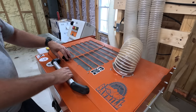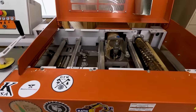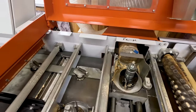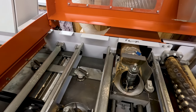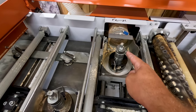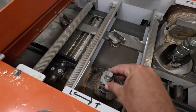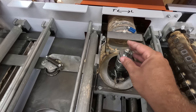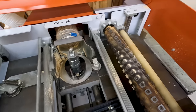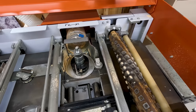Let me explain why we took all these boards down to Hawkins County and ran them through that edger. Alright friends, if you're new to this channel, this is my Wood-Mizer MP260 four-sided molder. What it does is it planes all four surfaces of a board on one pass. Or you can do two sides or one side. You can cut all these little motors that run these heads individually, not necessarily all four at the same time. So when a board enters this machine, it passes over this bottom cutter that cuts the bottom of the board.